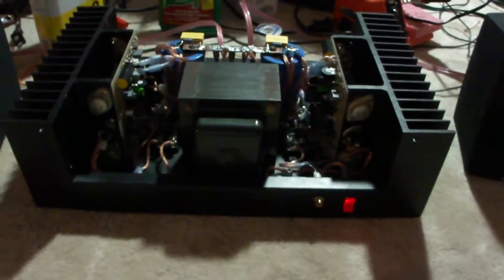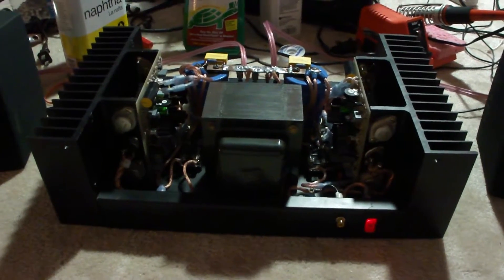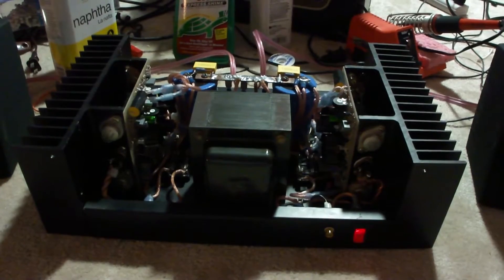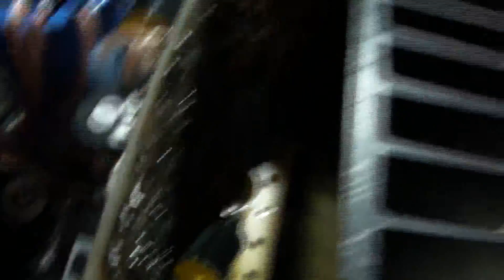I am done. I got the sample a bit over a year ago — June of 2011 — and we're done. I've rebuilt it from the ground up. I ran into a problem: I blew this channel, I screwed it up. I went through a pair of output transistors apparently, then through one another time. I didn't ruin any outputs this time, but I miswired one of the things to the back of the board.